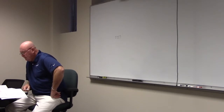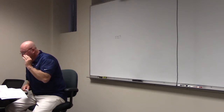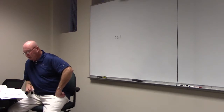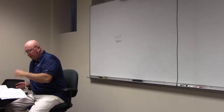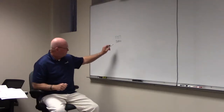And so we're going to take 8.75 or 8,750, and we're going to do what with it? Times 65%. How many appliances we got? Two? You sure? You ain't got but one range, right? One range. So we're going to take it times what? 80%. And it does it there in our book, which is 7,000. Okay? So we need to pull that out to the side. 7,000. Let's write that number down. Y'all with me on the range? Dryer load, 5,500. Boom. We're done, right? 5,500.